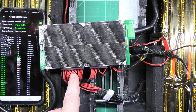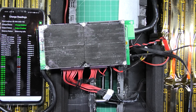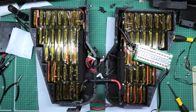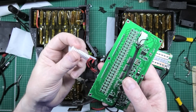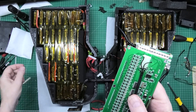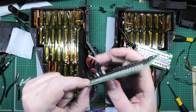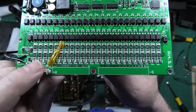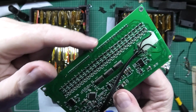So I'm either going to replace these with silicone ones or hardwire them to the BMS. The good thing about these BMSs is that because they're modular, you can take things off. I've got the connectors off. What I'm going to do is get some of my silicone wire and solder some flyleads on it, so I know there's absolutely no chance of any bad connections.